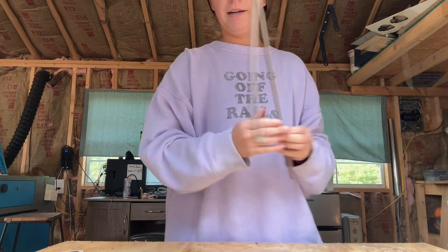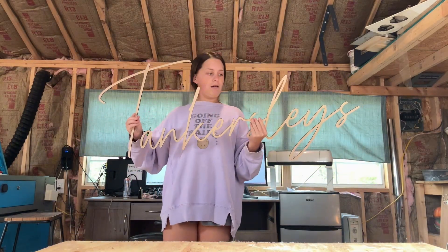Another thing I wanted to share: the reason it took me so long to figure this out originally was that my bed was unleveled. Make sure your bed is completely level when you start doing this, or else half the sign is going to cut well and the other half won't because the bed's uneven — these signs are about 22 inches wide. Also make sure you're pushing Get Position in the Move menu every time you move from the first target to the second, because it won't update automatically.